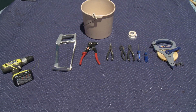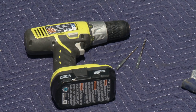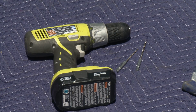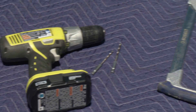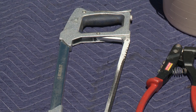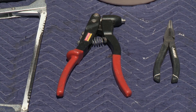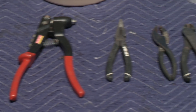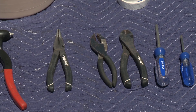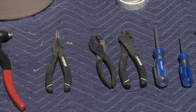In addition to the tools and parts in the standard kit, you'll need to collect the following tools. A battery-powered electric drill, drill bits and taps for 10-32 or 10-24 fasteners — used for the pullback device at the masthead. A hacksaw to cut the extrusion to the correct length at the top. A pop rivet gun to assemble all the pop rivets in the extrusions and joints. Needle-nose, standard pliers, and dike pliers to take the old headstay off and make the conversion, bending cotter pins and removing pins.